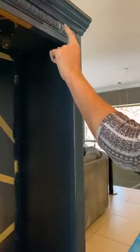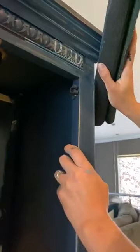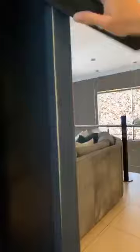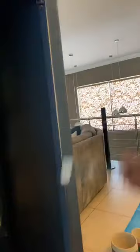I roll the sandpaper in my hand — this is Hamilton's sandpaper, 100 grit — and I sand, pressing hard. Can you see? Now I have a three-tone finish: the wood at the bottom, my white, and my blue. If at a later stage you want to add more white, just dry brush it onto your surface. I'm going to add more white on sections just to get the contrast better. I paint on and wipe off just to create that contrast.